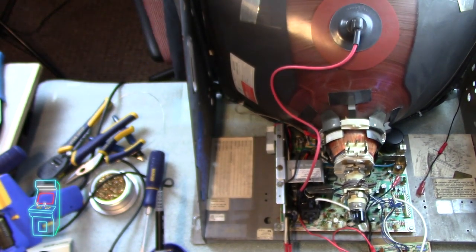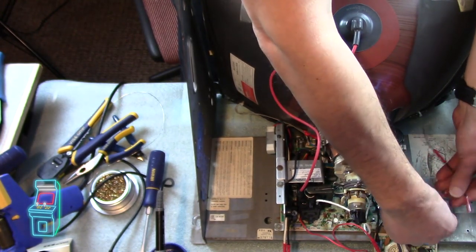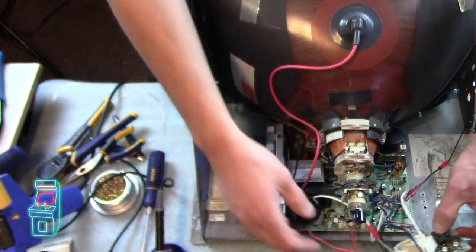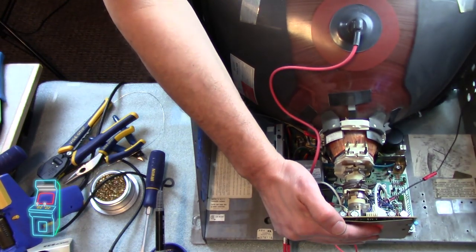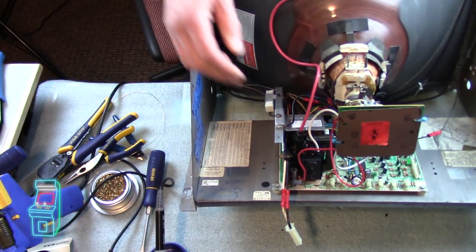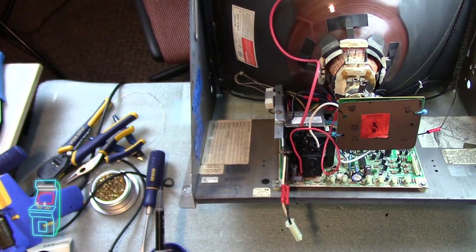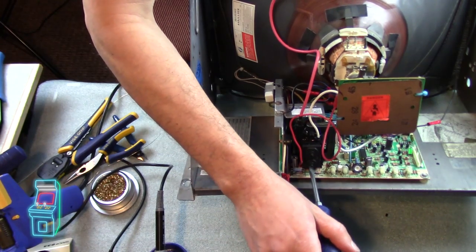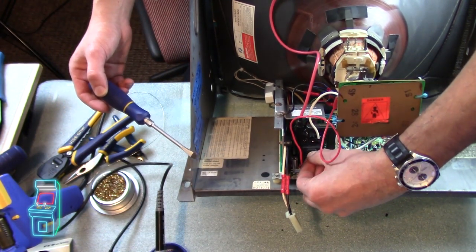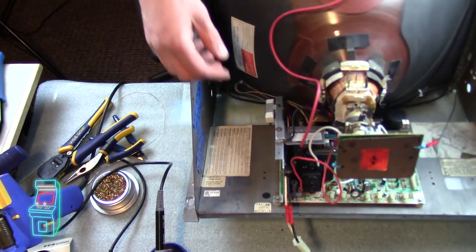So that's all set. I've got to plug in the wire — you cannot forget to plug this thing in, it's the ground. And everything else looks good. So there it is — a nice new flyback back there. Looks really good. We'll see how it behaves. So what I'm going to do is I'm going to turn down the brightness. I'd rather not have it set too high if possible and then we could always just turn it up.